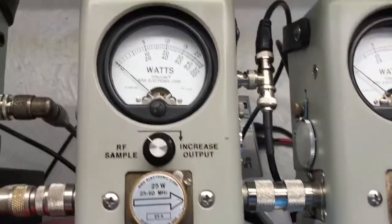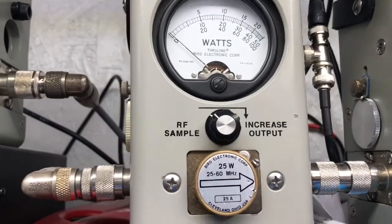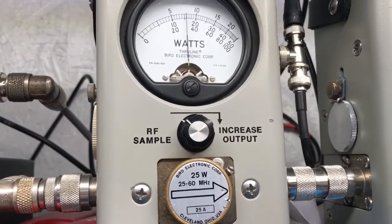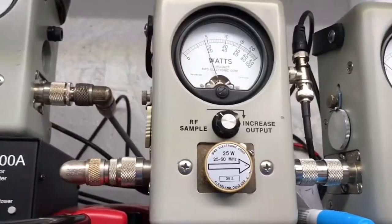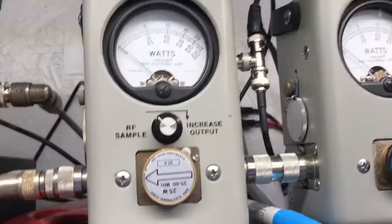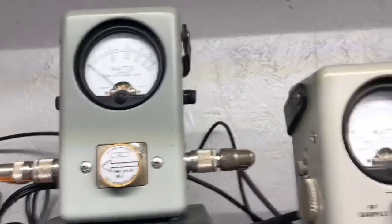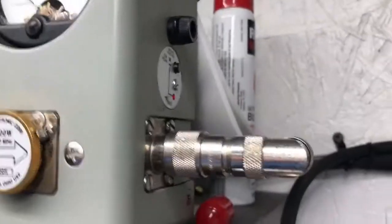Hello. Here you go. Hello, audio. 8 watts RMS. Hello, audio. That's doing that deep barrel voice. Now, if I'm just talking regularly, normally, audio, hello, break, 5 watts. So, turn it around. 25 watt reflect to the dummy load. 5 watt reflect back from the radio to the amp. 1,000 watt in average, no peak kit. And 25 watt in peak.